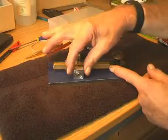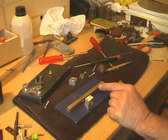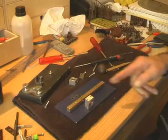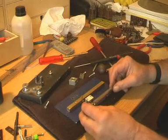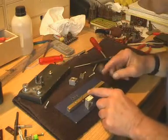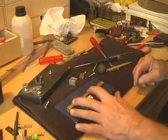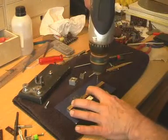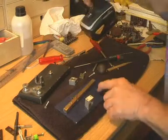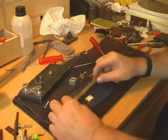As I did mention, the bearing blocks have got to be raised up. This is where we're going to have the first front contact. I say the first because we can drill more holes and have them all over the place. I moved it a little bit — it's about a quarter of an inch further forward. But the reason it's lying on the base is my marking out is so awful. I'm going to hold this bar down and just mark it with a drill, which has made a hole there. So we can drill for the bottom contact there.